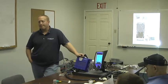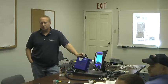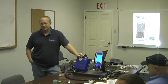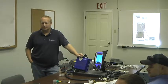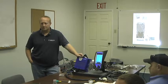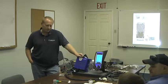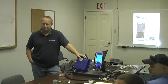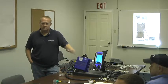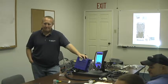Like when you start your engine and your voltage drops to around 8 volts system-wide, well, unless we have our protection circuit in there, it's going to drop out this LMI, and it's going to drop both powers out instantaneously, and when it boots back up, it's not going to link up, and it's not going to have what you need. So we're having to go to some lengths to ensure that that doesn't happen. And y'all's first crane out here is the perfect example of that, so we'll go over that when we look at it out there. You'll notice a nice new auxiliary battery mounted on the frame of that bad boy.